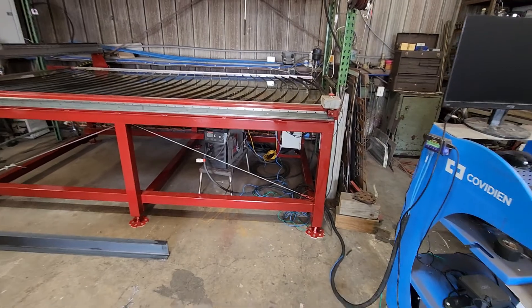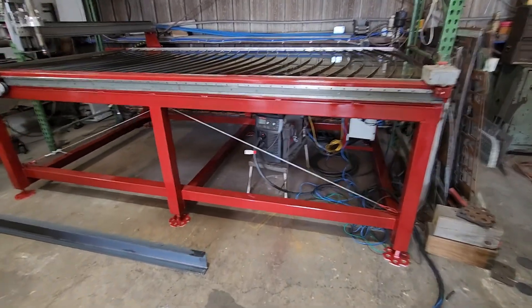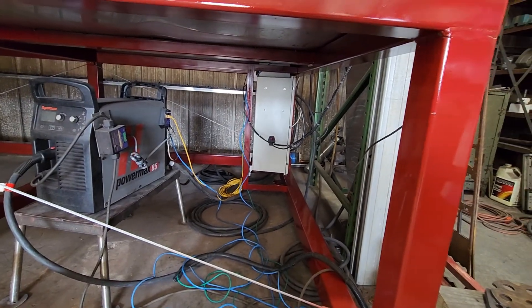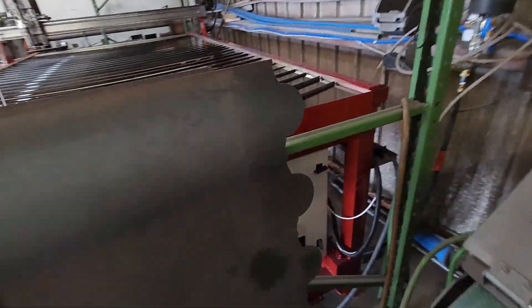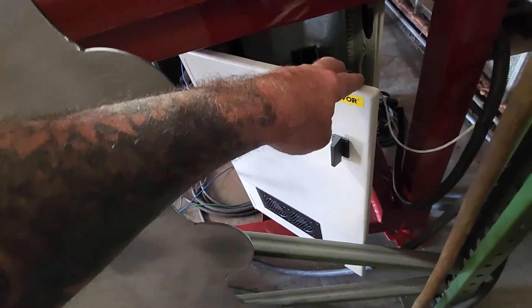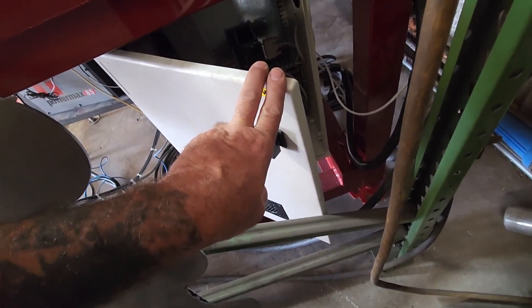Because of the limited space I have, I still might keep it and do something else, because it's only the three little wires. I just have the plasma cutter sitting on a little shelf for now. The bad thing is the frame of the rack is in the way of completely opening the door for my control cabinet. So I can probably cut this brace out or relocate it — weld it down there instead — which will allow my door to open and still keep the rigidity of the rack.